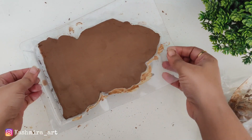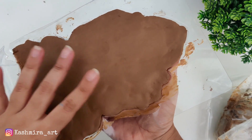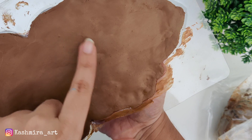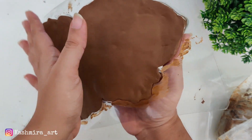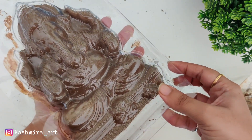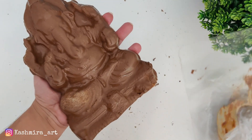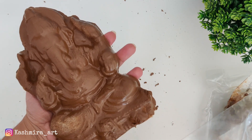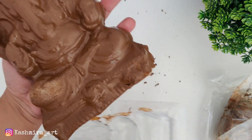After 24 hours, it may look a little wet but it will dry. We can remove the mold now. See how easy it is — it has come out because we had added oil. Because of the oil we got the exact shape, so don't forget that step of adding oil before.